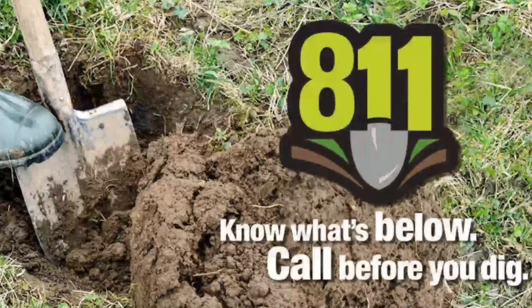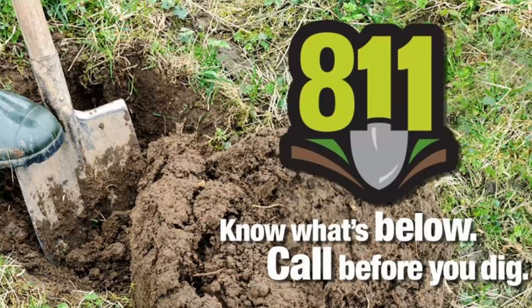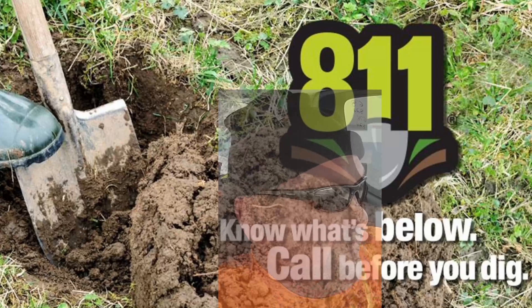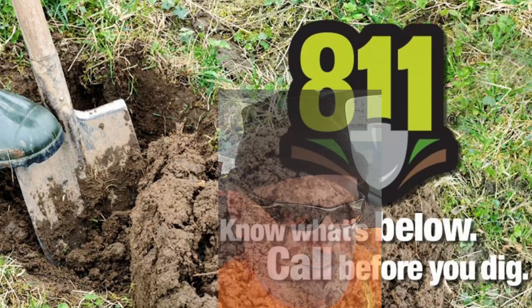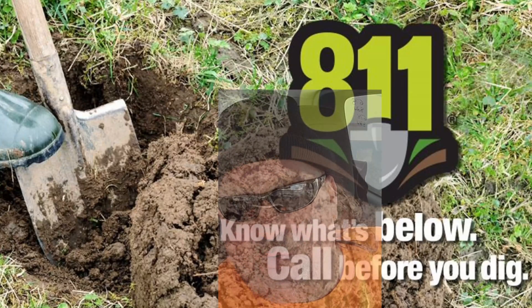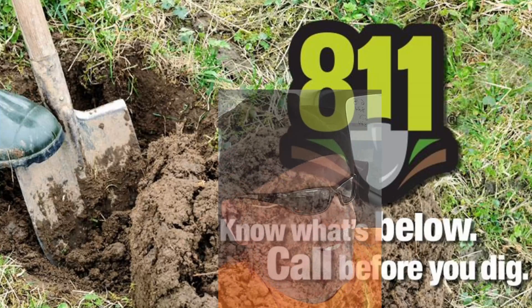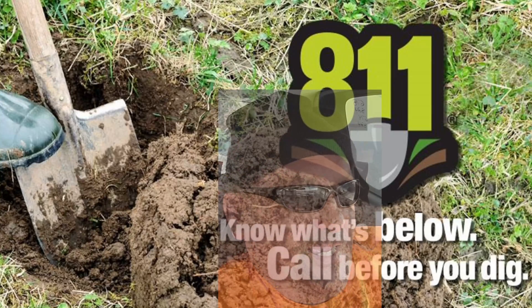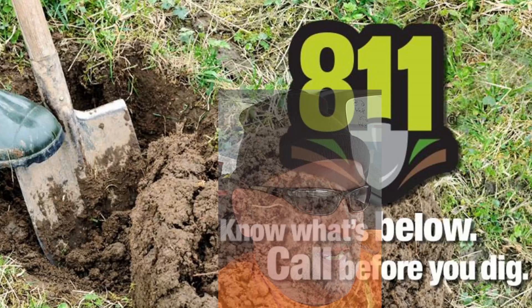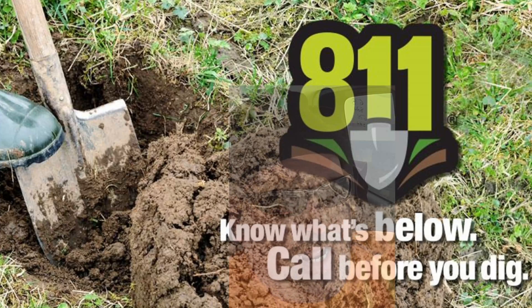Stay tuned. I hope you liked this video on this project and how we locate a long extent. You can see it's a hassle — it's not easy, it's a lot of work. You can see the ComEd line: the prints show cable replacement, and definitely there was a cable replacement because we hooked up to the Comcast line. The Comcast line was way out of the extent, so it wasn't a Comcast line — it was a cable replacement. The prints are right, prints show cable replacement. Please like, subscribe, and we'll see you on the next video. Thank you very much, have a good day.